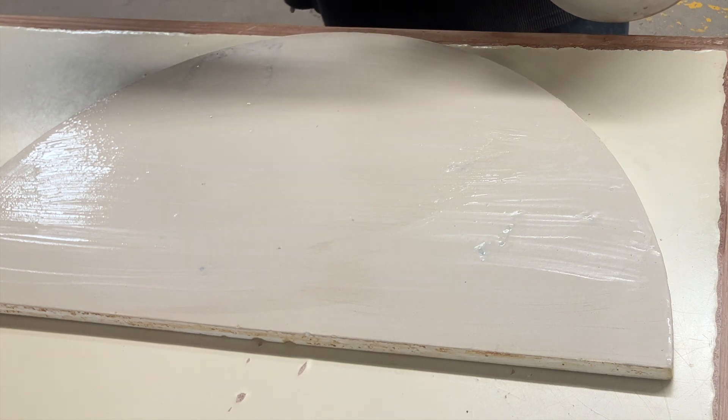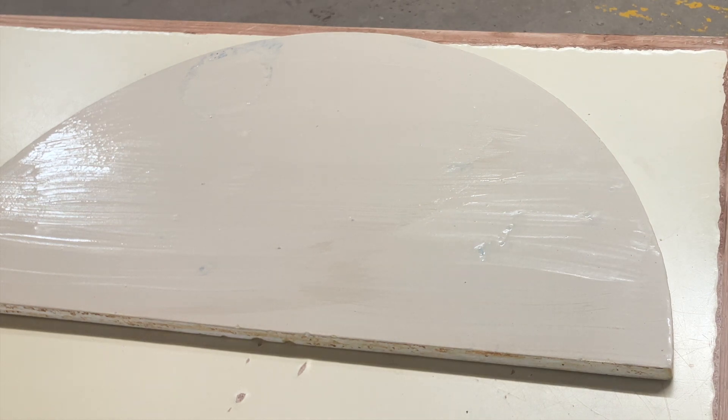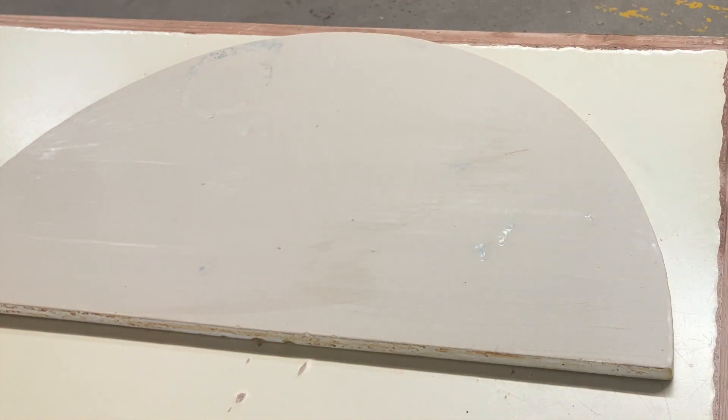You should be able to maintain the shelf with light scraping and occasionally putting one more coat on it. For most use, you can keep it in pretty good shape for weeks across multiple firings — unless something leaks onto it and you have to scrape deep or re-grind. If I get to a point where I have to do any re-grinding, I strip the whole shelf and start fresh so I don't have an uneven surface. Be safe when removing this material, do it outdoors, and make sure you don't accidentally ingest any kiln wash. Thanks for joining me — take care, bye.